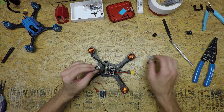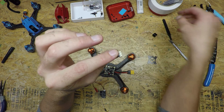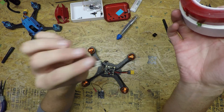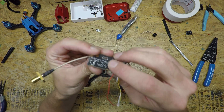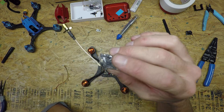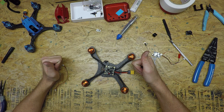The way I'm going to mount these: the bottom one has a lot of sensitive components right there with nothing covering it up, so I'm going to mount that one using servo tape because it has that thick padding — it'll sit nicely and won't move around. For the VTX, because it has a nice flat bottom, I'll use flat tape so it's not creating an extra profile. I don't need any vibration protection on this — it's never gone out on me because of that.